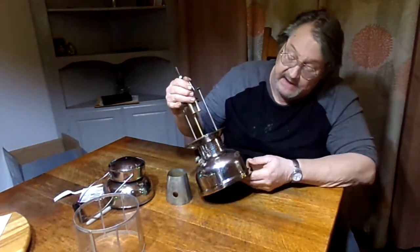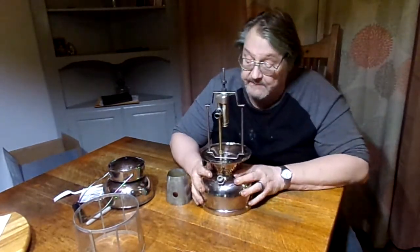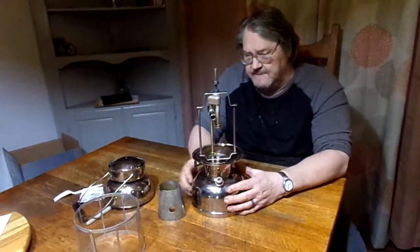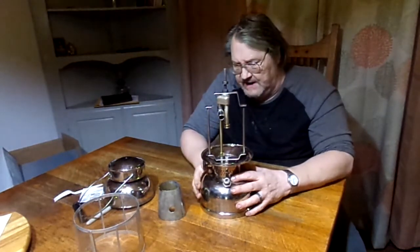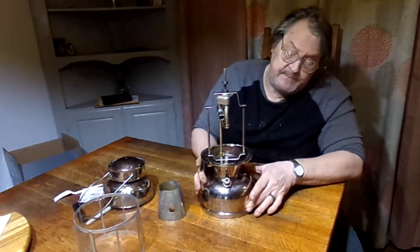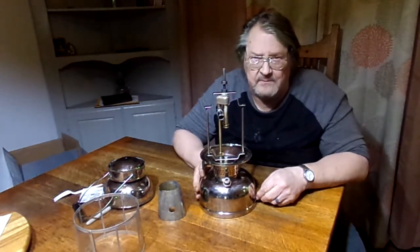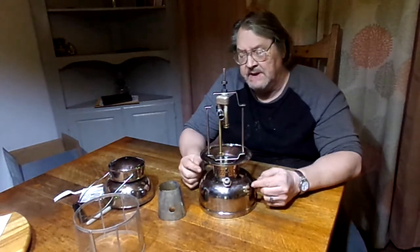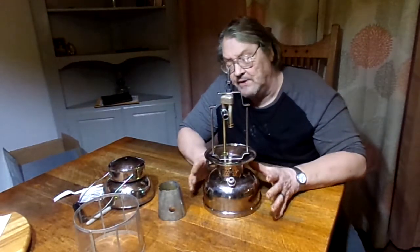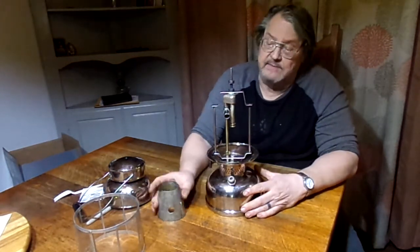The collar came out really, really nice. Bottom looks nice and original, so I think it came out really really well — I'm pleased with it. Tomorrow I'm putting the vent cone on and putting fresh mantles on. As far as the stress cracks, I did the best I could to cosmetically hide them. They're still visible if you look for them, but they don't just jump out at you. I gave the tank two coats of Caswell so it's good and solid. I pressure tested it and it really holds well.